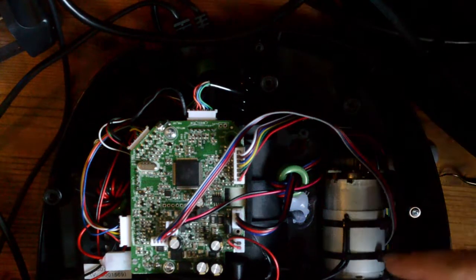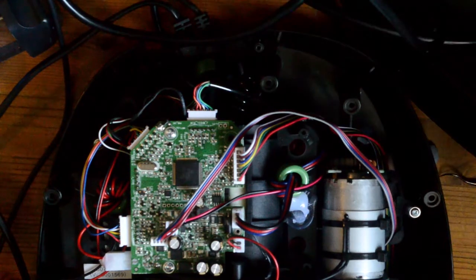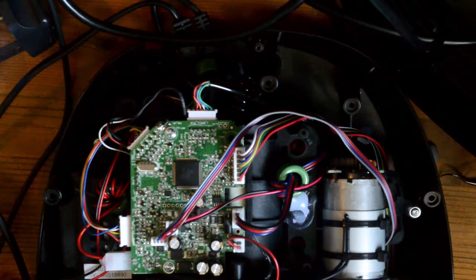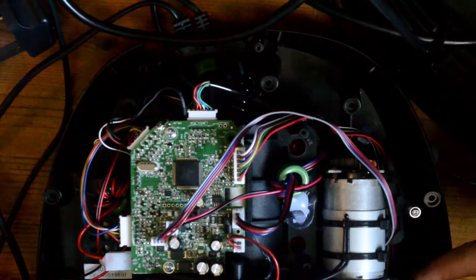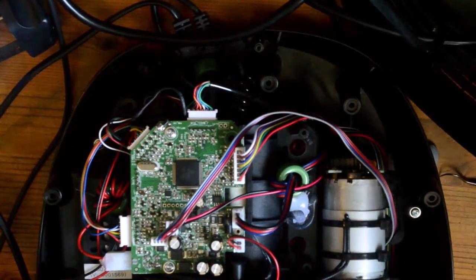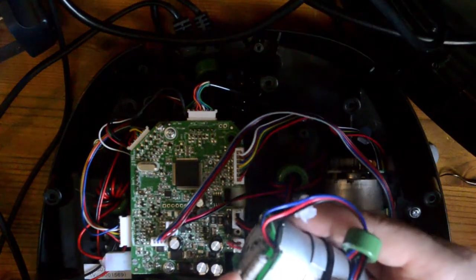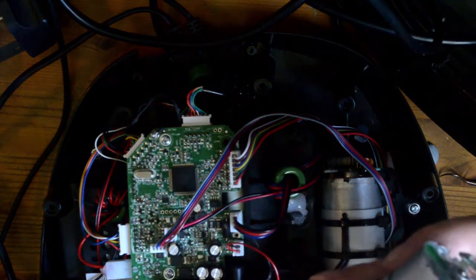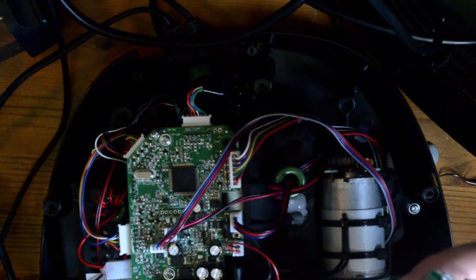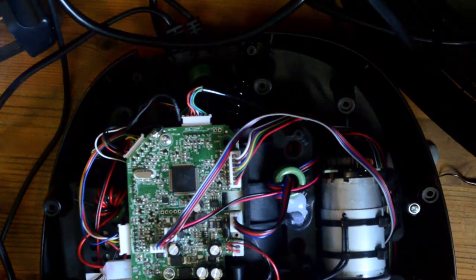The seller I was getting this off tried to talk me out of it. He tried to say it probably isn't the motor. He was saying it's more like the worm gear, this thing, or down here we've got the optical sensor, and he was thinking maybe it was more that. But for me, this resistor here was getting hot, and there was more friction to the left than there is to the right. I don't understand why, but it wasn't working properly anyway, was it?